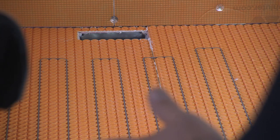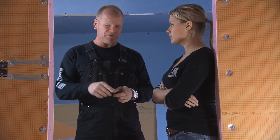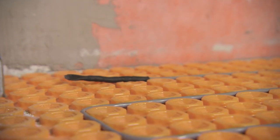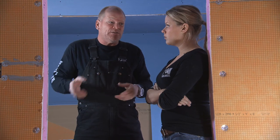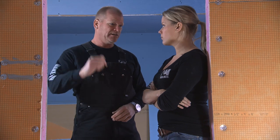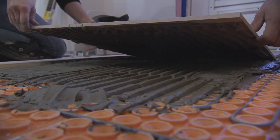Now that the heat cable's down, we have two heat sensors. You're gonna run two heat sensors — you cut out just one puck and the sensor lies right in. The reason there are two goes back to the thermostat box: if ever in the future one of the sensors fails, you have a spare sensor inside the box, so we won't have to pop up tiles to fix it. After that's done, set tile — you don't have to wait. Literally, you put this down within 30 minutes maximum and you're tiling.